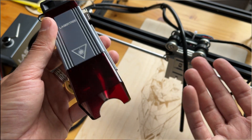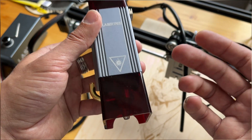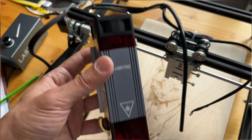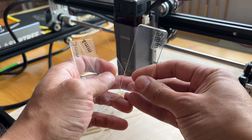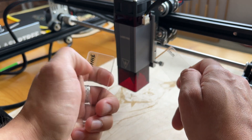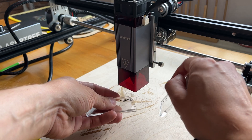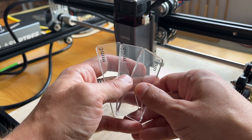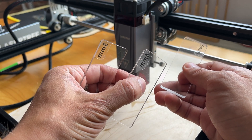The larger focal spot is somewhat of a downside — it means slightly less precision. The depth of field is small. You can put down two layers of material to raise it, effectively 3mm of adjustment. By raising or lowering the material, you can increase or decrease the focus to best suit the material you're working with.